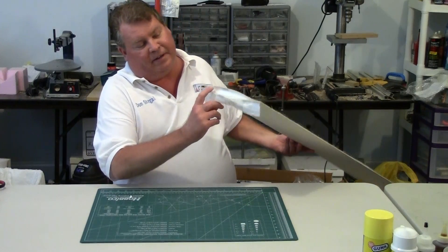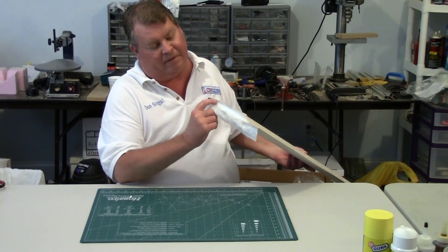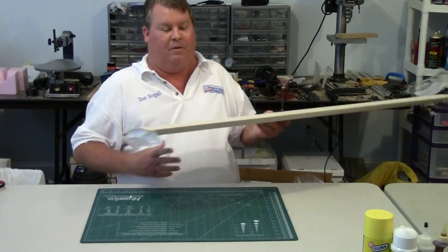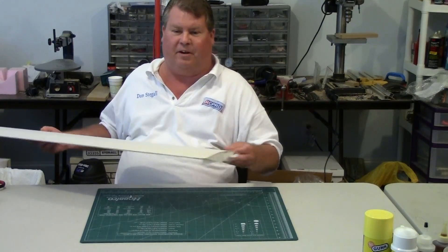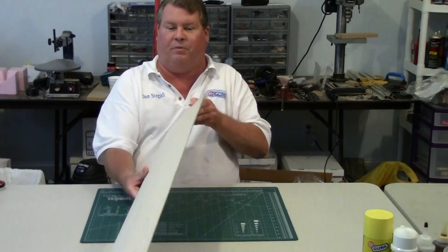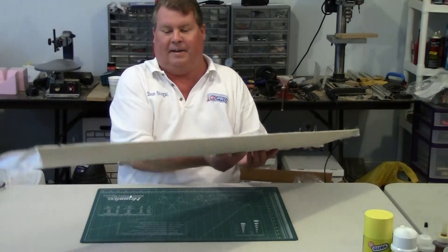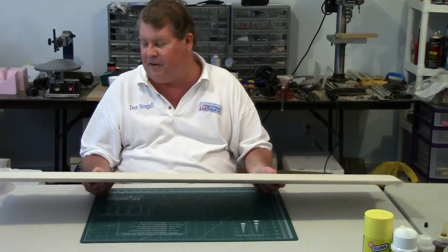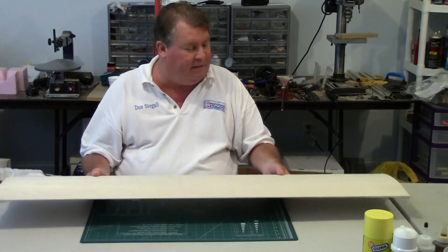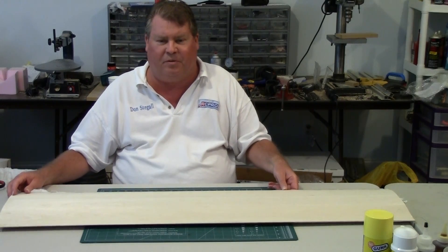What I do is use a piece of thin folder cardboard and mark a line approximately where the foam is so I can trim the ends. These wings come out nice and straight because of the techniques I'm using. I let them cure for 36 to 48 hours under the vacuum — this one's actually been under for several days. But these wings are strong, and I hope that answers some questions about the porous release film.